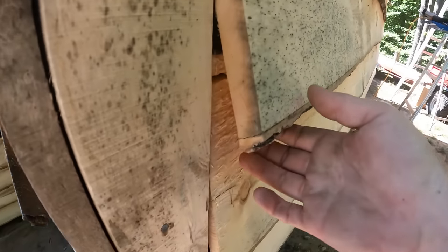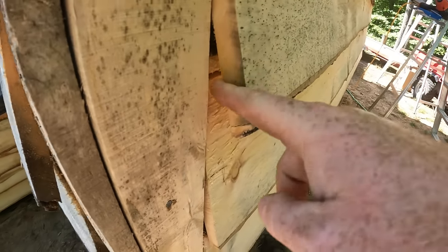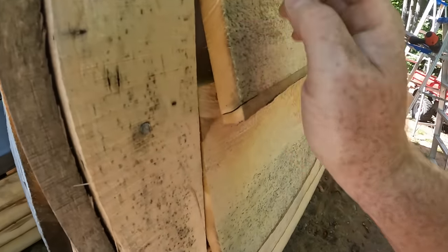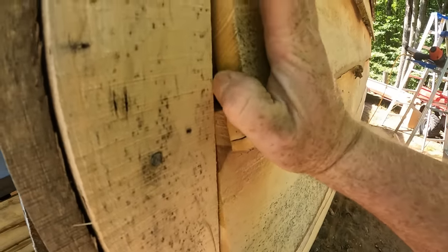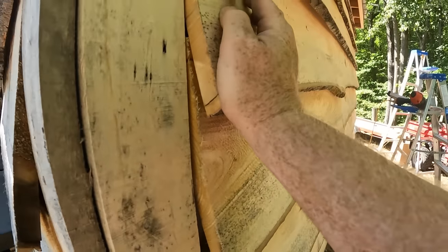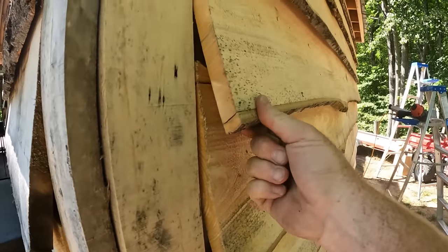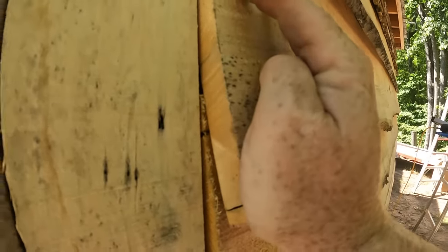You know, again, see, but put a little weight on it, double tap it in. If it curls, like this one's curled pretty good, I can still push it down and let it stick out, but I've been nailing it where it hits the top of the board. Like this one, guys. Okay, push it in, and then I'll come back and I'll caulk all these bigger holes so bugs can't get in there. Same thing with this. Still loose, but push it in, barely any gap at all.